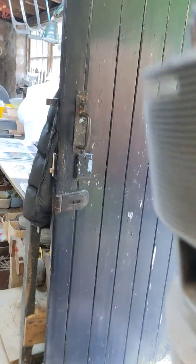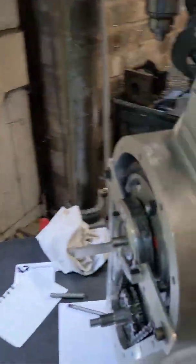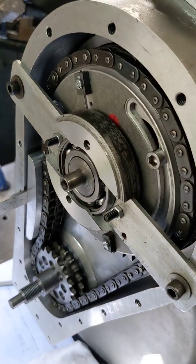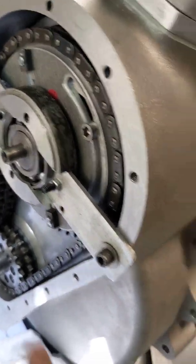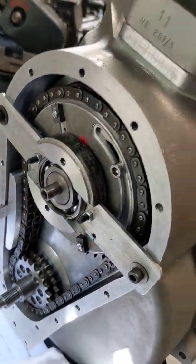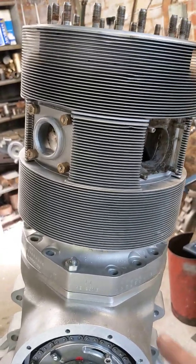While I've got this together, it's a good way of showing how it works — or partly how it works. So if I move the engine against the direction of rotation, which will be that way — remember this is the chain that's being pulled by the crank — you can see that at the moment the exhaust ports are just closing.